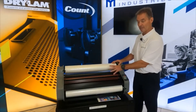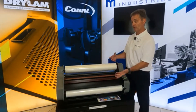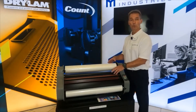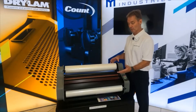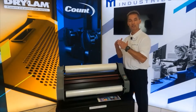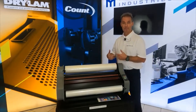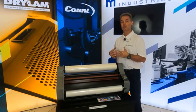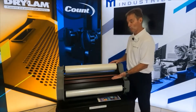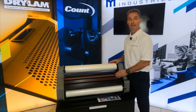All Element Series laminators have heated front rollers and rear pressure rollers that work in combination. Another safety feature is that the rollers are mechanically joined together, so if the front roller stalls or stops, the rear does too. This eliminates buckling between them — buckling causes wrap-up, which costs a lot of time and effort to untangle. This design means you can stall the machine and it will stop and save your project; you can back it out or increase the speed to move it forward.